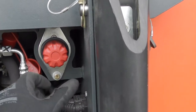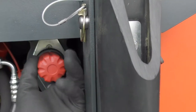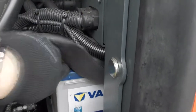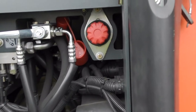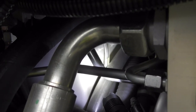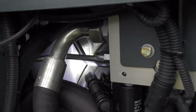You'll see a battery isolation switch — if you hit that it will cut battery power from the battery to the machine. To re-engage it, just screw to the right until it's fully locked. Below it, under a protective rubber shroud, is the battery itself — it's good to just feel the connectors. For any workshop staff looking, you can see the fuel filter just behind there with a water tap right at the bottom. If there's a leak of oil or water you'll see it underneath the machine, and the hydraulic oil level is visible through that gap at the rear left of the machine.